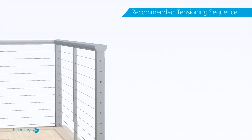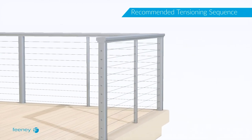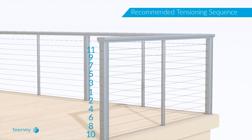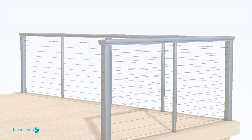Now repeat steps 2 through 12 for the rest of the cable rail conceal kits. We are now ready to begin tensioning the cables with the special CableRail conceal tools. Please note the recommended tensioning sequence to help minimize stress on the railing frame and easily adjust uniform tension across all the cables. Start at the center and alternate until all cables are tightened.